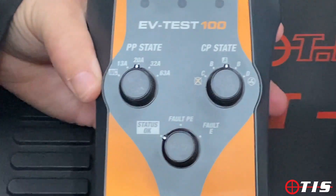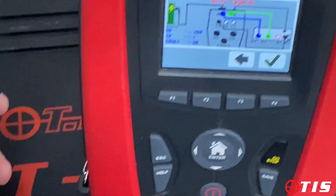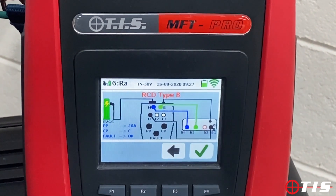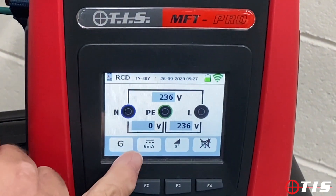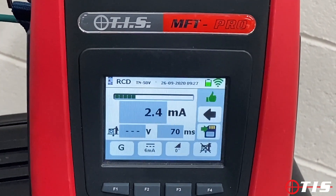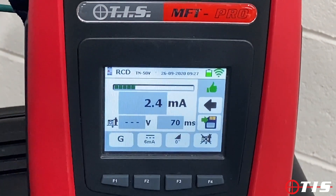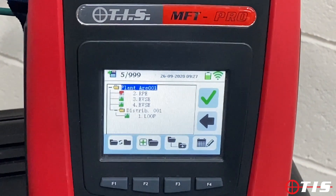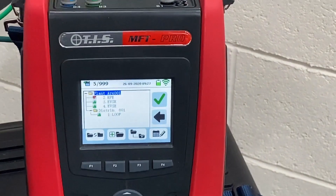With the RCD reset, we tick the box and move the CP state back to C, still at 20 amp and status OK. Now it's going to perform an RCD test type B, which is DC sensitive at 6 milliamps. We tick the box on the MFT Pro and it shows it's ready to do the 6 milliamp DC test. We press go — it comes out at 2.4 milliamps at 70 milliseconds, so the RCD test is correct. We save the result and it now says end of EVSE, with all results stored on the MFT Pro. Thanks for watching.